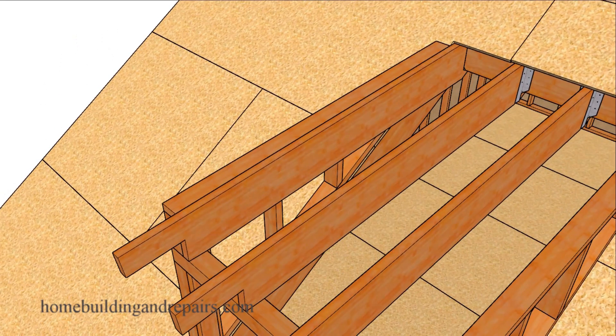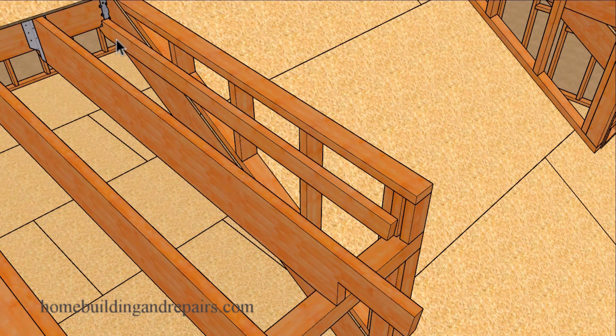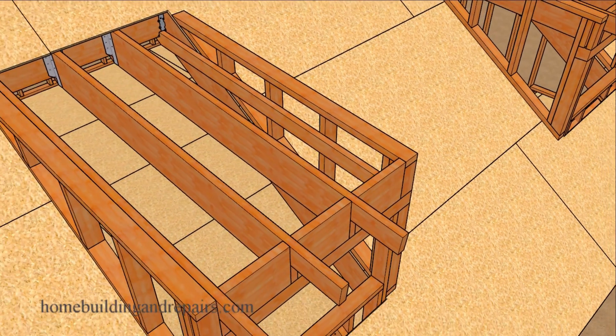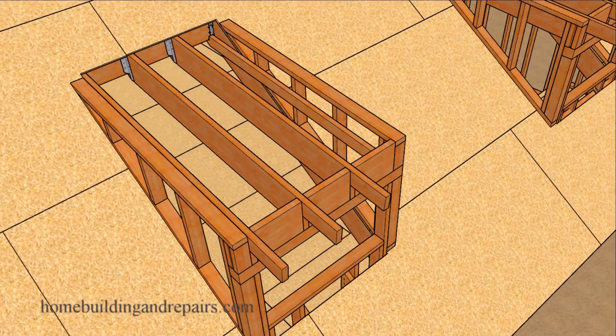In this example I will be providing you with two different ways that you can finish each side — one with a piece of ceiling backing here and no rafter, because we're going to use the top of the wall to support the roof sheathing. Eventually I will make another video showing you how to do a couple of different dormers, along with different methods for building the walls, finishing the front wall, how it connects to the other wall, and how you can set the rafters on top of the wall framing if that works better for you.